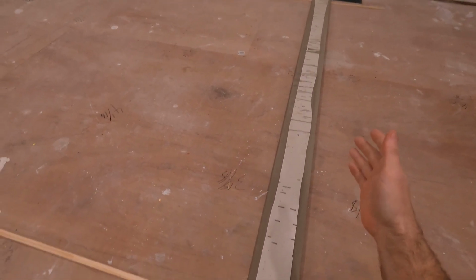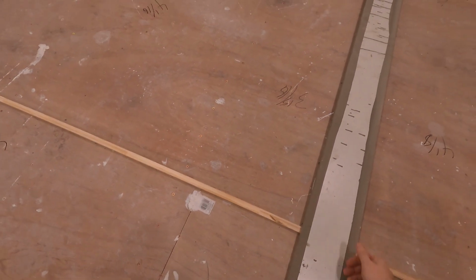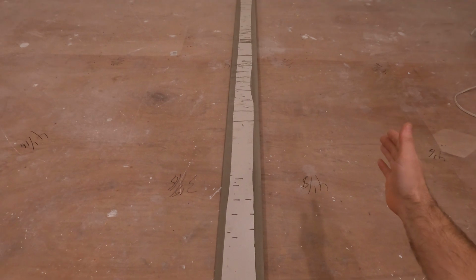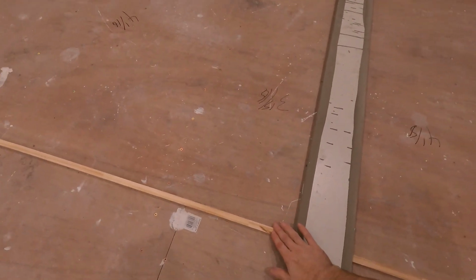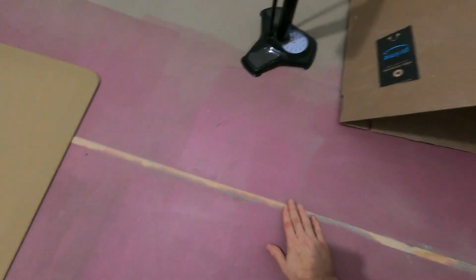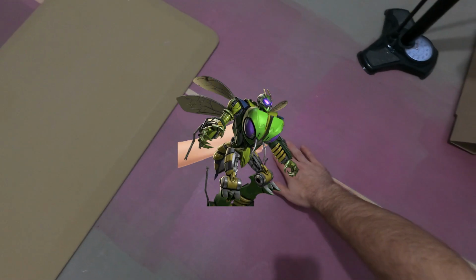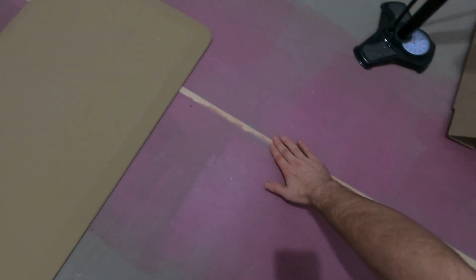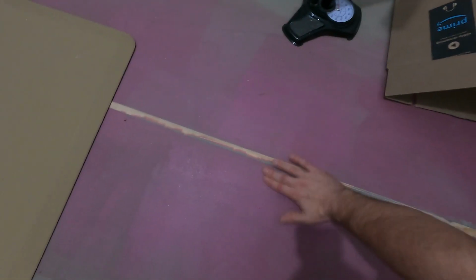Once it's all screeded out, I have found that it doesn't like to get up to edges of things very well. You can put in as much as you want, and as soon as you've run your screed over it, you'll find there's a little bit of a dip. It's usually about a 1/16 of an inch. And then I can come along like I did here with a multi-tool, I call it a hand wasp, and just trim off the very top of that little piece of wood. And there is no edge left here at all.